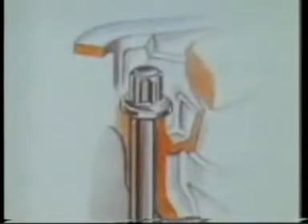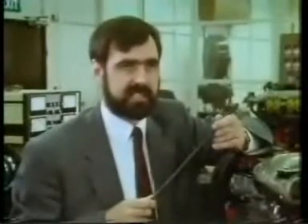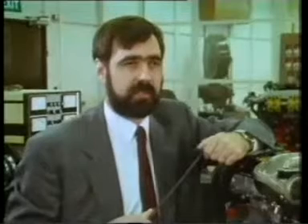The plan to use the bolts was suddenly offering elegant solutions, but Rover still had to make sure that the engine would be mechanically stable. We got a lighter block, but also a block which was less stiff than would otherwise have been the case. So it was very important that we make sure that the block was still able to carry those loads arising from forces other than the combustion forces. In a vehicle, the whole engine beams — that is the name we apply — which means the engine and gearbox assembly effectively bends as the forces arising both within the engine and from the suspension are applied to it.